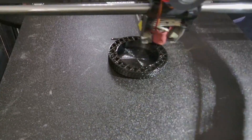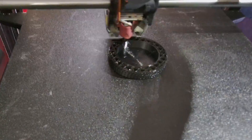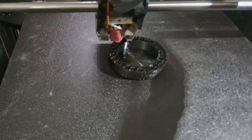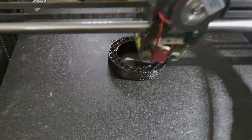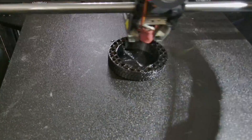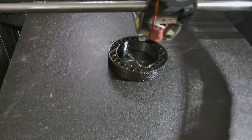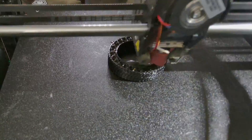For this print I wanted quality with the tread pattern. First layer with TPU I always choose 0.25mm — it gives a little better adhesion to the bed and fewer first layer problems. I've had first layer issues with TPU in the past and this has always worked well for me. Layer height I choose 0.15mm; for a less detailed print I'll crank it up to 0.2, 0.25, or even 0.3 on some prints.